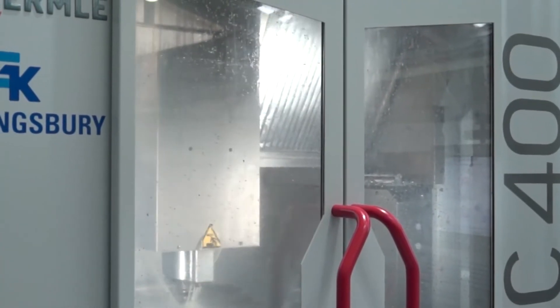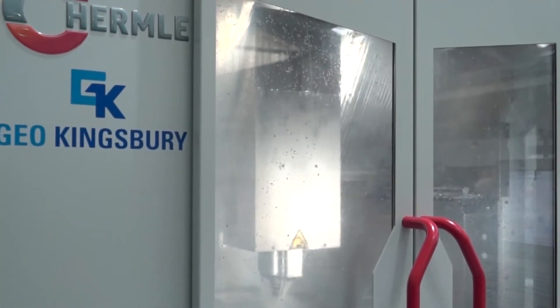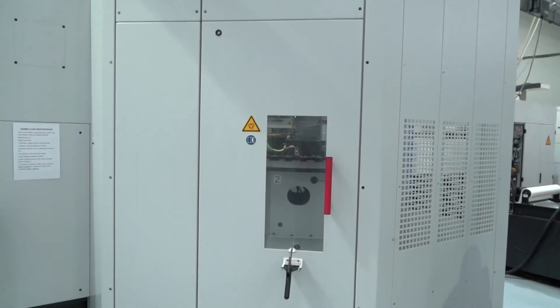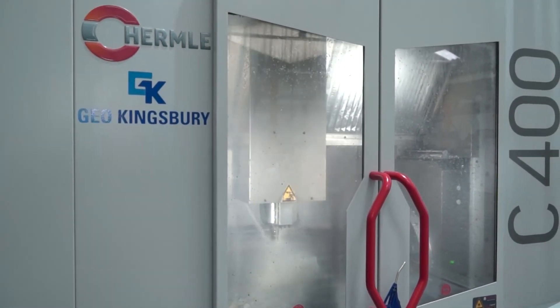On the A-axis and C-axis, a lot of manufacturers make a big play for stability. This machine has a single drive on the A-axis, supported on the other side. It's also a fast machine - on the linear axes, all axes run at around 40 metres per minute. The machine is a one-piece casting made of an epoxy resin with granite inside. And when you see these machines out in the field, it's not uncommon to see machines up to 20 years old still producing aerospace parts.